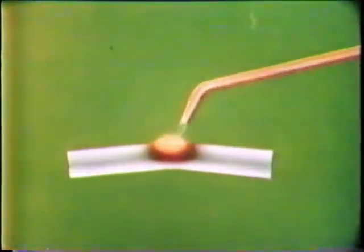Now let's go back to our original bar and see what happens when we heat only one side. Getting up close, we see that expansion in this case is localized and uneven. The surrounding cool metal acts similar to the vise and restrains expansion in these directions, but there is no resistance to expansion in this direction. It is obvious that this uneven expansion causes an unnatural displacement of metal. When this area starts to cool and contract, a small amount of that displacement becomes permanent.